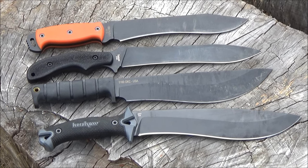Now this brings us to the consideration of the overall shape of the knife. What do you want your edge to be like? Do you want the edge of your knife to be completely straight until it gets to the belly of the knife? Or do you want more curvature? Do you want a recurve on your knife — do you want it to recurve into a flared-out body? That'll make it very top-heavy. Good for chopping. You can see these knives don't have straight edges — they curve inward and then meet the belly, which curves the opposite way. A completely straight edge has its benefits: for example, if you want to use it as a cleaver, it's easier, and it's also easier for many people to sharpen. But a recurve, like with a Kukri, has its benefits too, because it helps the knife not slip off the target during hard chopping, and the knife will be more top-heavy.